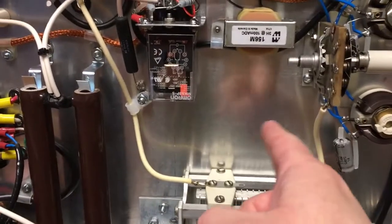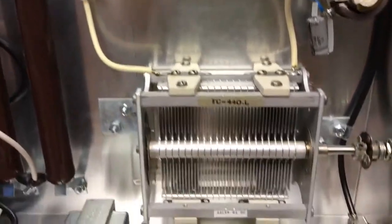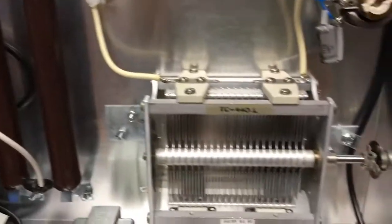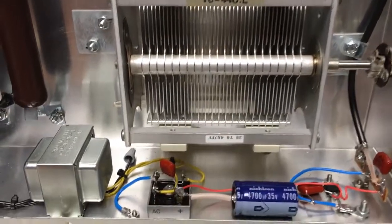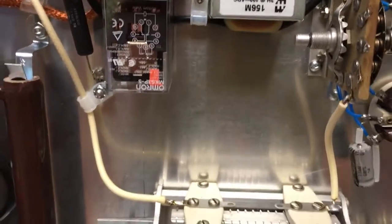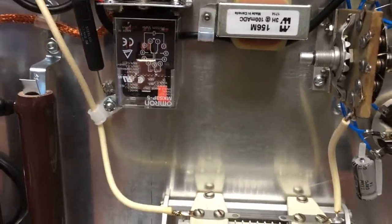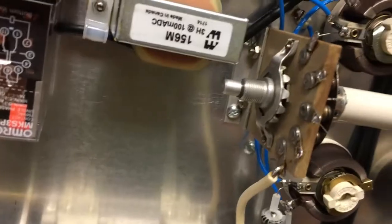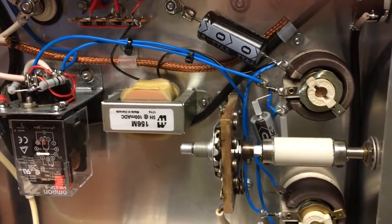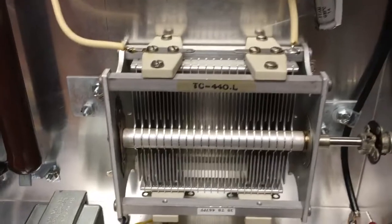One thing I left off the first video is I need to add the doorknobs back here for the loading caps on the output network. There's the one big loading cap for the output of the Pi network to the coax output, the SO-239. That's 38pF minimum to 467pF maximum. I just need to add the doorknobs in parallel one at a time — I'll drill a hole and mount them right here. It'll be connected to the selector switch on the front panel. That's actually the switch out of a Johnson KW matchbox. Right now they're all shorted, and now they're open — that's what I was using to short across the doorknobs to add more capacitance in parallel with the variable loading cap.